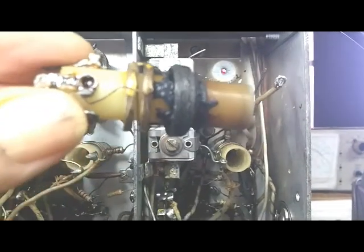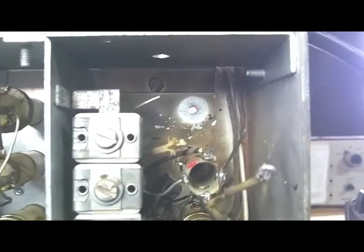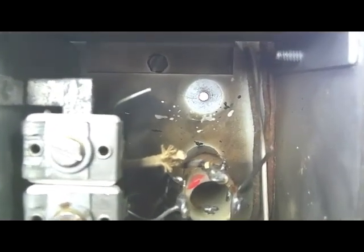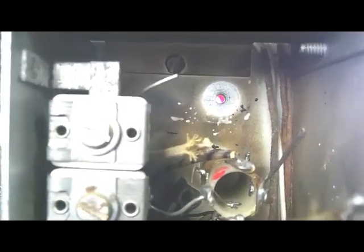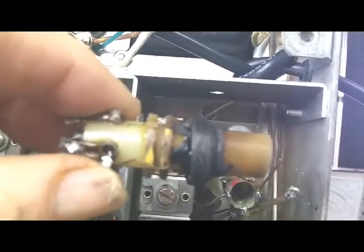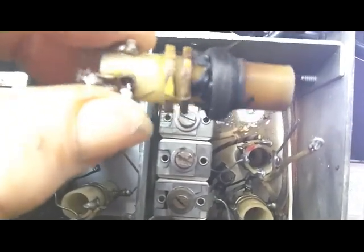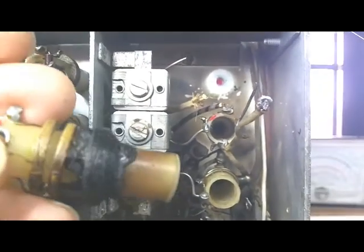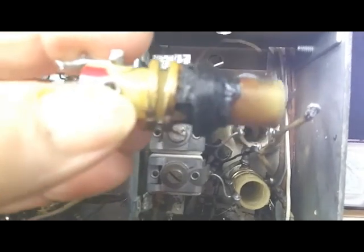I took the band 1 out, the broadcast band, and you can see it's charred on the primary. I haven't checked the secondary yet. And if you look closely in now, I should have seen this earlier. It's all brown and charred on the bottom of that chassis. So I don't know what happened, especially to burn all 5 of them out. So I don't know. Is this radio now a parts radio?